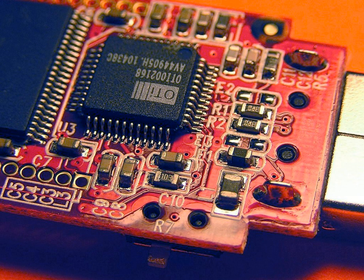SMDs cannot be used directly with plug-in breadboards, a quick snap-and-play prototyping tool, requiring either a custom PCB for every prototype or the mounting of the SMD upon a pin-leaded carrier. For prototyping around a specific SMD component, a less expensive breakout board may be used. Additionally, stripboard-style protoboards can be used, some of which include pads for standard-sized SMD components. For prototyping, dead bug breadboarding can be used.